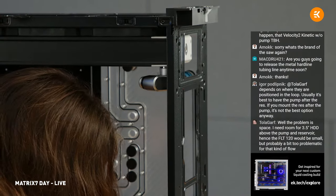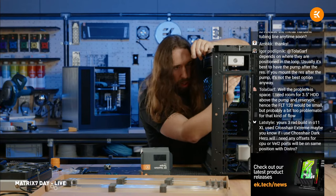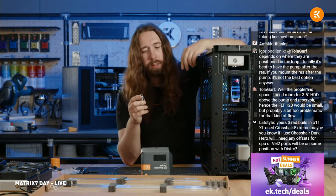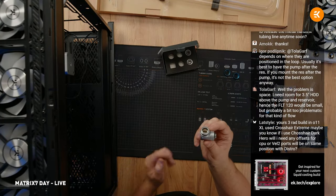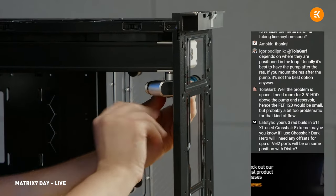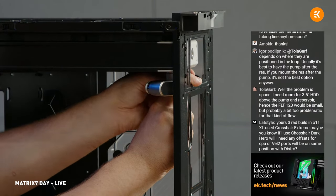Oh no. Got it. I see the mistake that I did now. It was not bad maths, but the fact that this fitting is much less, the end of the fitting is much closer to the center line of the port than the double rotary. So they're not exactly the same. I considered that I was using two identical 90s, but in fact my double rotary was quite different, so I made it much too short. But there we go, got it right now.